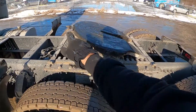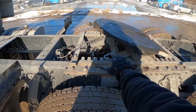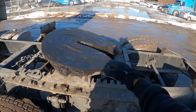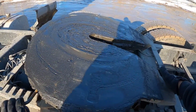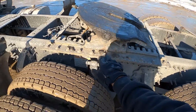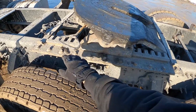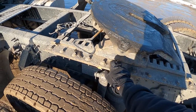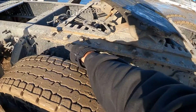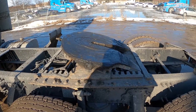Next, inspect your adjustable fastener and lever — no cracks, no damages, and it's not bent. My fifth wheel — no cracks, no damages, fully greased, and it moves up and down. My pivot pin, chain, and coupler — no cracks, no damages. My pivot pin fastener, chain fastener, and coupler fasteners are all tight and secure — none of them are loose and none are missing.